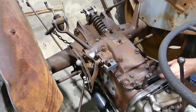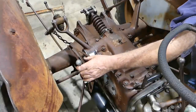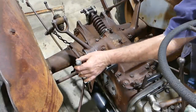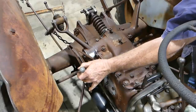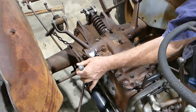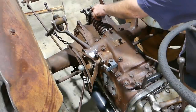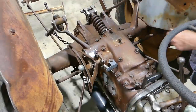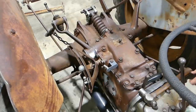Okay, that's working. Now, you can see I could just move the lever a bit and have it adjust the position of the implement. I'd be interested to see now if an implement puts pressure on there, what happens. So I'll go and get the bar, and let's just do that for the fun of it. Because your draft control, I'm imagining, will be out of range, which is fine.